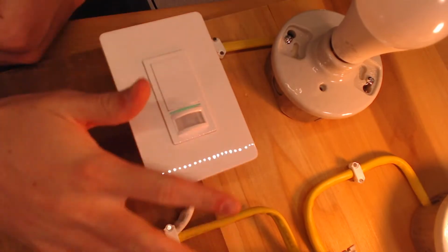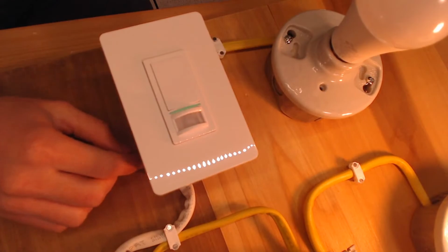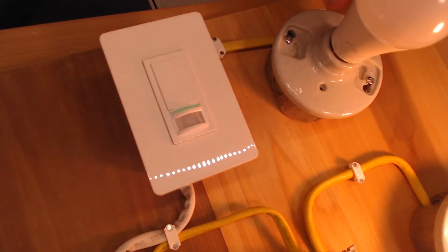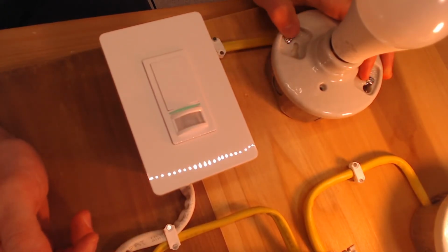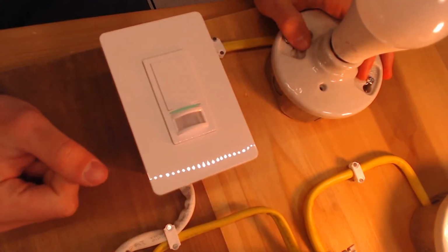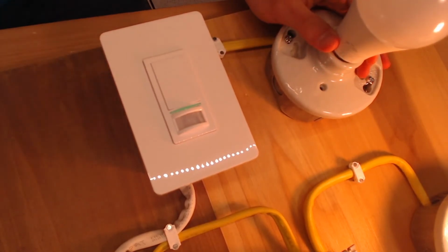So it's pretty basic. By default, I don't have the motion and the actual relay coupled together, so I set one up in a shed, and I had it set up in Home Assistant. Whenever it detected motion, it would turn on for X number of minutes and then turn off. Unfortunately, that didn't work the greatest because, stupid me, I installed it next to our heater in the shed, and these motion sensors work by detecting movement of heat. So anytime the heater kicked on, the lights would kick on. Since it's winter here and we don't want stuff freezing in there, we've got a heater. So that has not worked out the greatest.